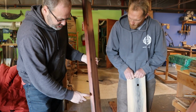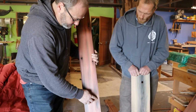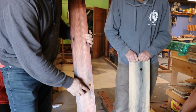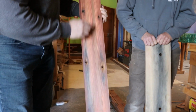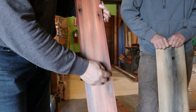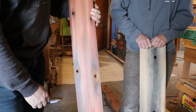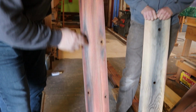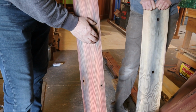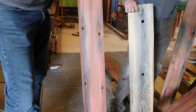Some of these rail fasteners going through, they were square 4-inch long steel nails. So that reacted with the wood, starts to break the lignin of the wood down, so you get that discoloration or delignification of the wood around each fastener. So that's what this extra color is at each spot. And then the black in it is just that iron starting to break down and get sucked into the capillary of the wood, going down the structure of it.